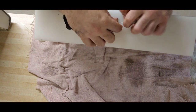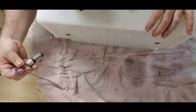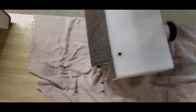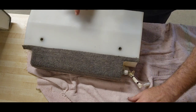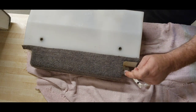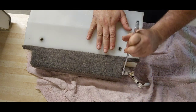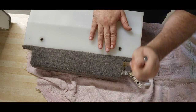I'm going to start this by pulling the check valve and screen out. I was debating whether or not to replace this, but now I'm sure that I am. It's starting to get a little funky. This is going to be our water filter. Behind it is the float switch. We're not going to mess with that. I believe we need 11/16 for our filter screen. Correct. So let's go ahead and get that out, and I'll show you guys what the filter looks like. And then we're gonna flush the tank out.